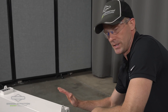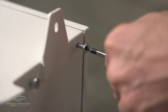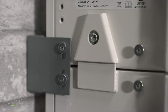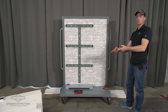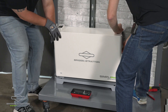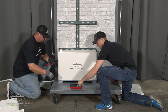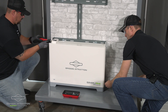It is important before you start assembling the battery modules that you remove the shoulder screws nearest to the wall brackets. These shoulder screws will pass through the wall bracket to secure the battery modules. We are securing the module to the base with a Phillips 2 machine screw.